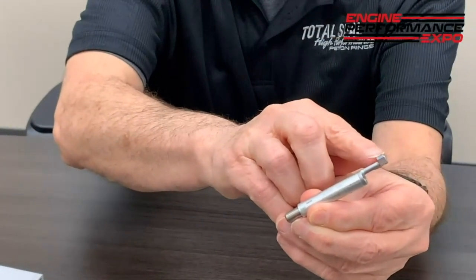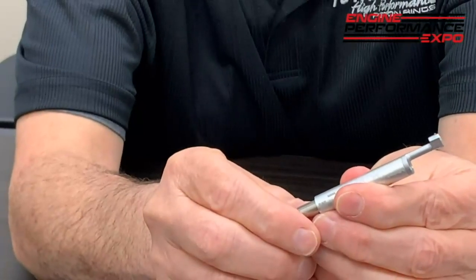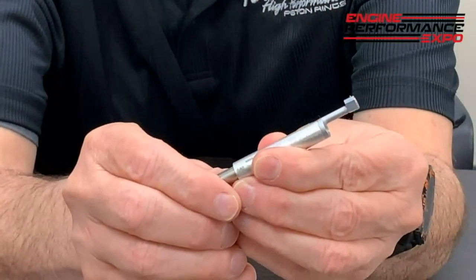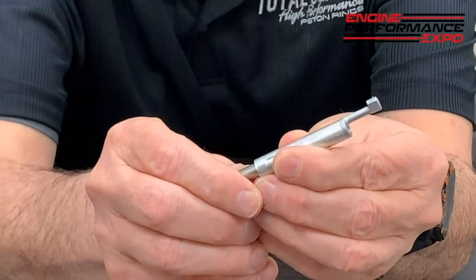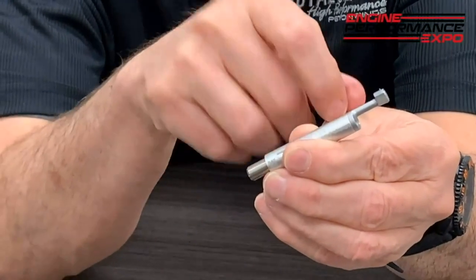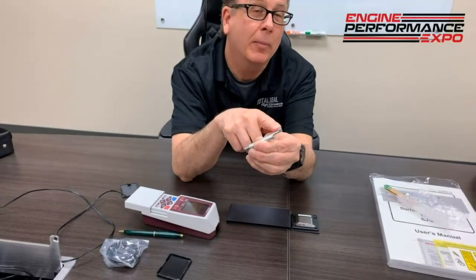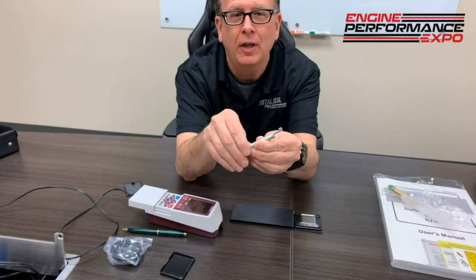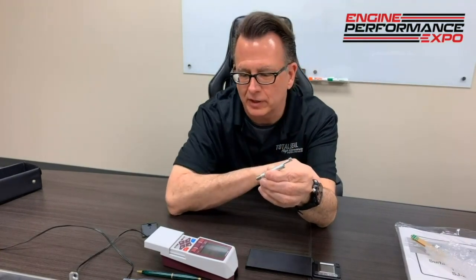This is the stylus — there's a small diamond, kind of like a needle on a record player, sticking out. These are pretty expensive, so treat this thing like it is something expensive. We don't want to drop it or bounce it off the floor. I had a gentleman whose machine kept reading over range; we deduced the stylus was bad, and he found a little dent where somebody had dropped it. When checking cylinders, make sure the cylinder is clean — it doesn't have to be hospital sterile, but clean. Use brake cleaner, lacquer thinner, whatever you like. This does not like oil. Treat it like the expensive part it is.